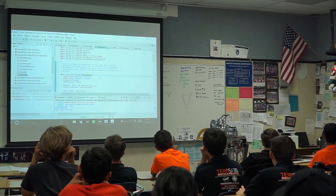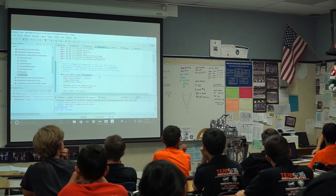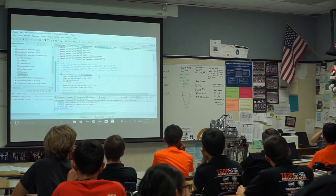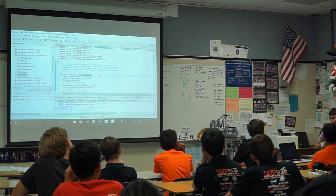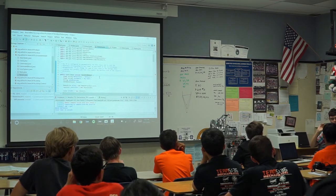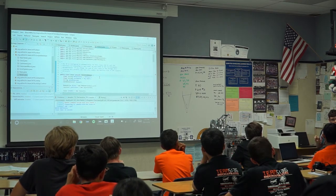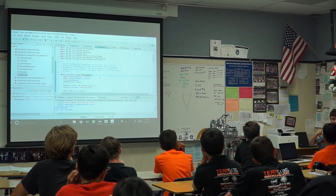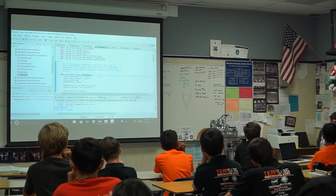We actually had a problem in 2013 on 696 where the guy who wrote the autonomous code, not me, by the way, really quickly hacked together a thing that just told the code to stop doing everything for about 3 seconds and then shoot, and then 3 seconds and shoot again. What ended up happening is we didn't have control of the robot for 3 seconds after autonomous because the autonomous code was still running. There was no way for the FMS to tell it to stop because that loop hadn't finished. Instead of looping it, it just ran once. We couldn't figure that out until I looked at it. I'm like, dude, that's the wrong way to do this.